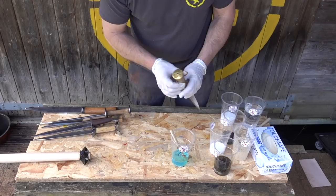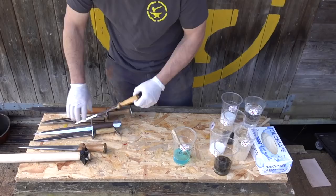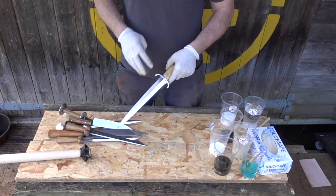There are a few more pieces with brass on, so I'm just going to age those up. You can polish this right back showing a bit of black, a bit of brass, and a tiny bit more brass on this pin washer at the end. I've knocked back the polish on all of these knives now, just taking it back with some wire wool and fine sandpaper — just giving the chemicals something more to bite into.